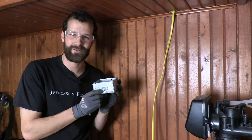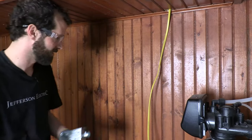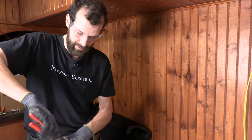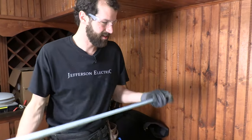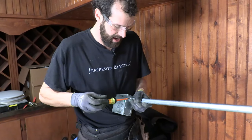Let's go mount the box. I didn't have a half-inch KO closer, so I used two fender washers, a through bolt, a lock nut, a lock washer, and a nut to close that up — equivalent or better for restoring the enclosure. Now cutting our conduit down. They do make conduit reamers; I've always just used my pliers to spin around — works well. If it doesn't cut your finger, it's not going to cut the wire. All cut ends should be reamed — no question. If you don't do a lot of conduit work, use the pliers method; if you do a lot, buy a conduit reamer.